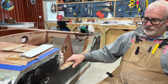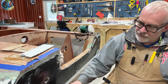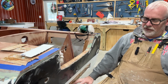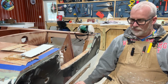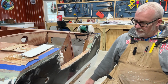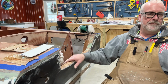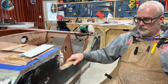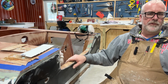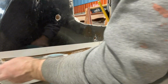And I don't know whether I would have known. It seems like I remember seeing the glass and even having resin squirting out, so I figured I was covered, but it obviously settled. This was probably also starved, but this resin sunk and then adhered and hardened, and it obviously left this area, went to this area, and I lost. So we're gonna fix it, and it'll be better than it would have been if I hadn't fixed it. So lesson learned.